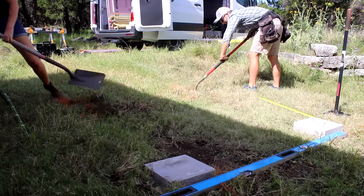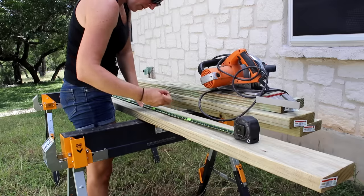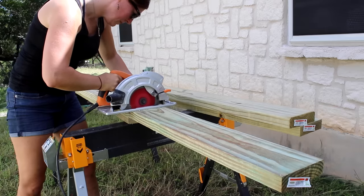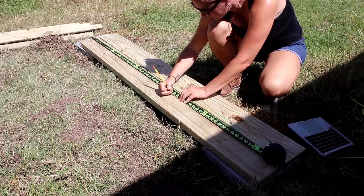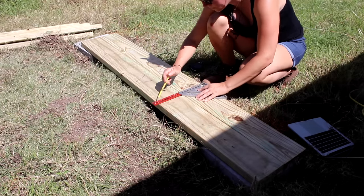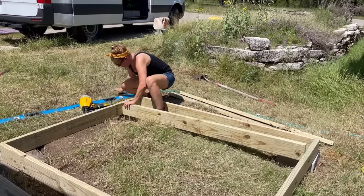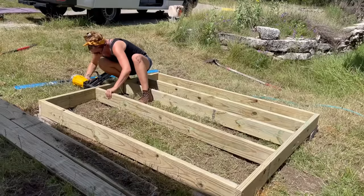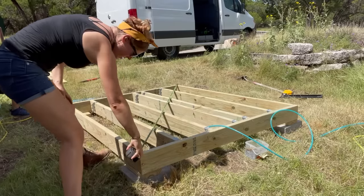With the help of my employee David, once all the pavers are leveled and squared, I moved to cutting the deck material. I'm using pressure treated lumber and a Triton circular saw. To mark joist locations quickly, set two boards on top of each other and use a Crescent speed square with a six-inch extending arm to mark both boards at the same time. Place an X on the side where the joist goes, then use a nailer to attach them — or screws if you don't have a nail gun.